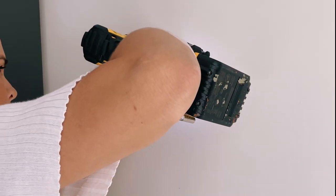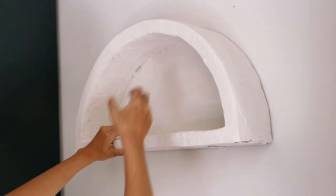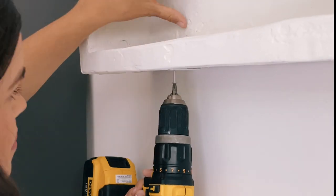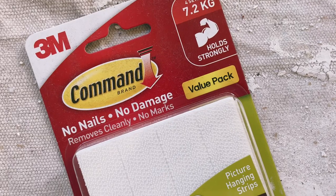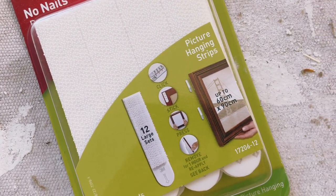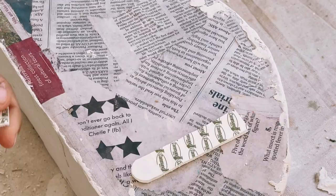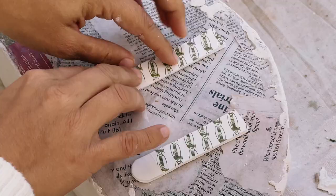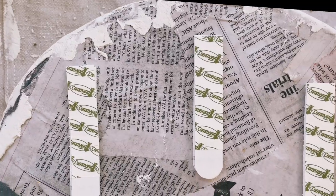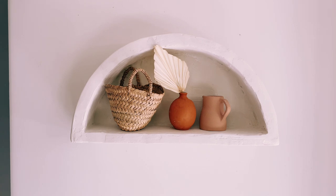When sanding I made sure to focus on rounding out the edges so it had a really nice and uniform shape. To hang it I just used a drill and some L brackets — I hung those on the wall first and then placed the shelf on top and screwed them in from the bottom. But never fear if you're a renter or you just don't want to get out the drill — you can use some of those 3M command picture hanging strips. I use three or four depending on the size of the shelf. You probably don't want to put too much weight on these, but a few trinkets or vases should be fine.